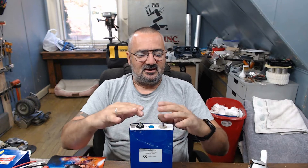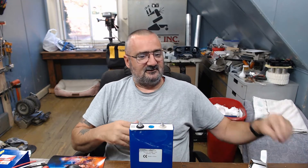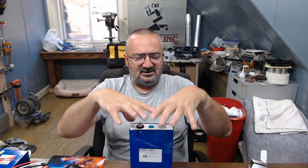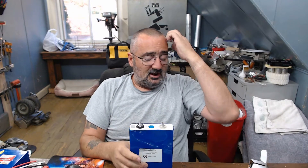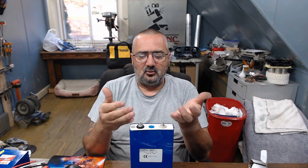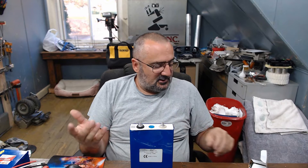These things are full of angry pixies, so when you're working on them you need to cover these terminals to be safe. You can see I'm wearing a ring — I shouldn't be. Take that ring right off; watch band, metal clasp, take that right off. Do not have anything metal near this when you're working. But I realized — hey, brain farts happen — how can I do a field-expedient way of making sure these terminals are covered up so bad things don't happen?